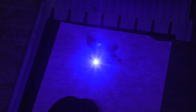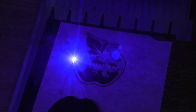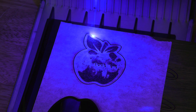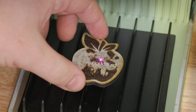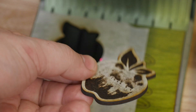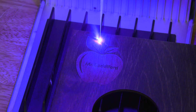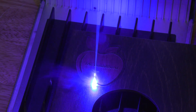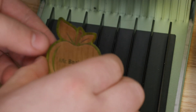For the last test, we ran some tests on the XTool F1, and this is the laser that struggled the most. It just had a really hard time marking the material effectively, but it did do a great job cutting, which gave us some ideas for some projects later in the episode. We're focused on the mark right now, and this definitely leaves a little something to be desired. We do eventually get it cleaned up, mostly by removing the mask, which really helped the laser carve into the surface of the wood more consistently. It's still not perfect, but with a little trial and error, you should be able to get something usable out of this laser if you really do need to mark this.